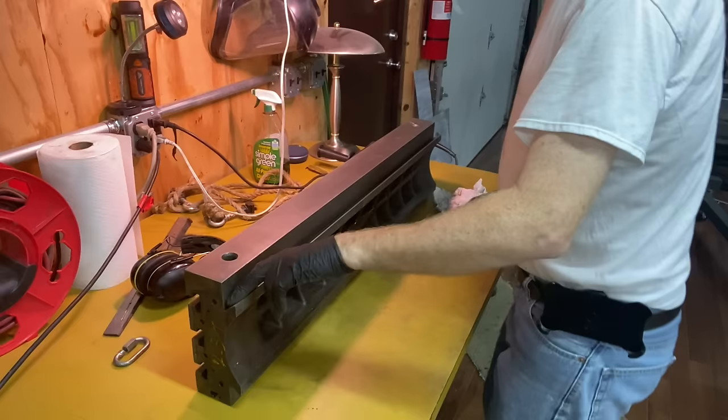I'm going to get the excess wiped off and give that some time to dry. Alright, I'm ready to try to mill the top off this. I thought I pressed record but I apparently missed it. This was cutting real well but it has stopped cutting. Let me try a different cutter — try to take shallower cuts. I think that bolt must be hardened steel because this cutter stopped cutting well too. I've got a carbide bit here — it's broken on the sides, but from what I can feel, the bottom still has sharp teeth. I'm going to try this. Hopefully the carbide will cut that hardened bolt.